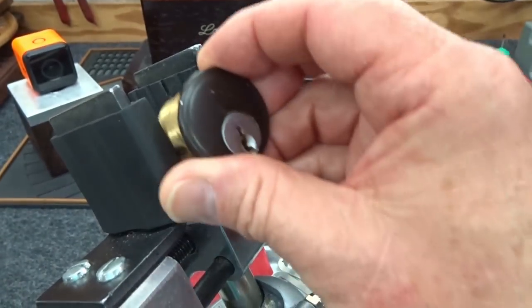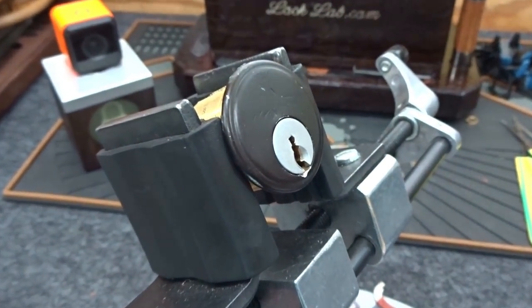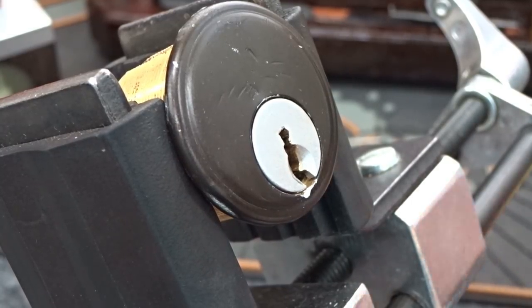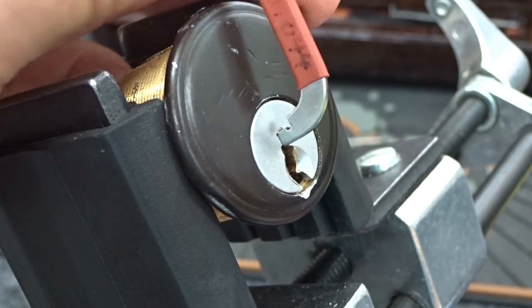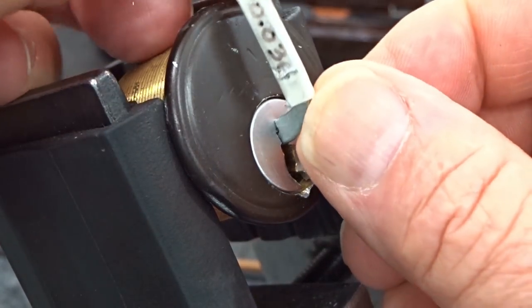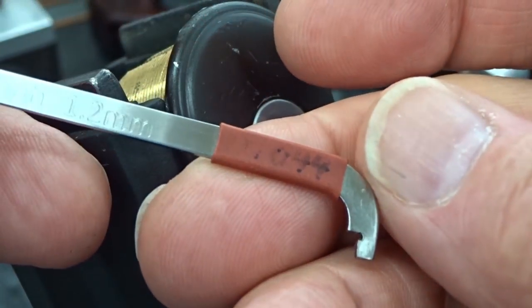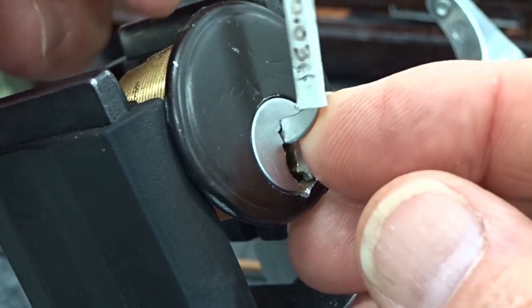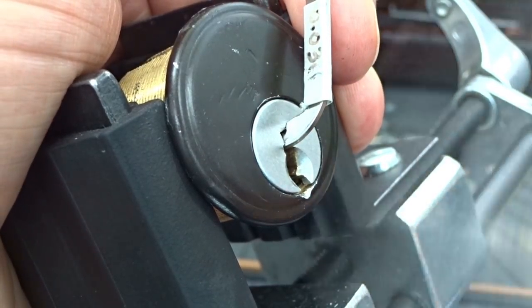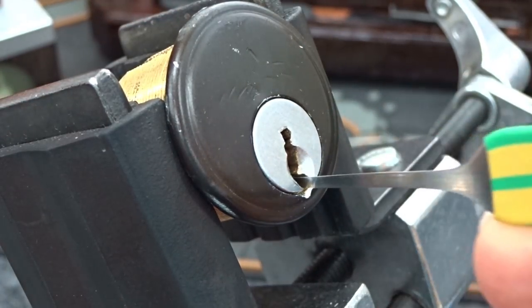I hope I don't miss this eclipse - the next one's not for like 60 years and I doubt too many of us are gonna be around for that one. Topping the keyway - that's a little bit too thick, so the red one. Going to the white one, the middle thickness, and that's way too floppy. I can use 36 thousandths; the red one is 44 thousandths but it won't fit.